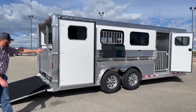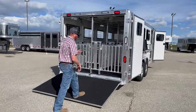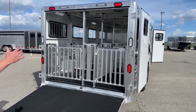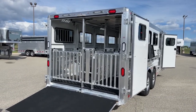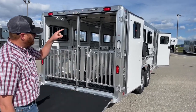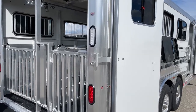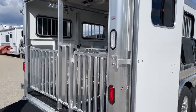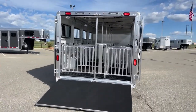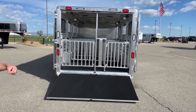As we get to the back, this door is on the side of the trailer. Over the years the standard has been a welded hinge with a greaser, but it only allows the door to come off at 90 degrees. At shows everyone's crammed in and you have these doors winged out, constantly opening and closing them. So we opted to do these wraparound hinges — as you can see it gets to the side of the trailer, out of the way. Now you can work off the trailer without messing with the doors. We do this on all our small animal trailers. We have dual 50-50 doors that are independent, so we can work one way or the other and get them to the side to show off of.